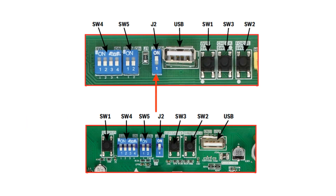The J2 switch is used to change the unit size from 3 to 2 tons and from 5 to 4 tons. It is the single dip switch and is colored either blue or black. Change the J2 switch only if you are seeking to have a matched pair system.